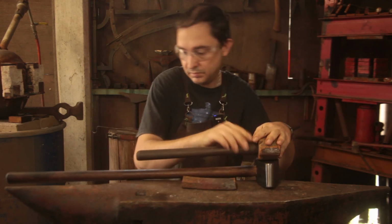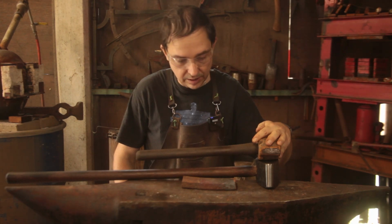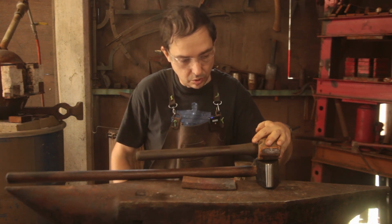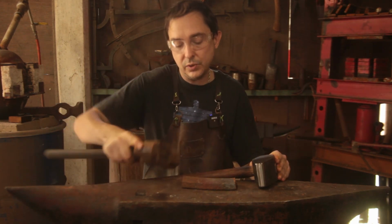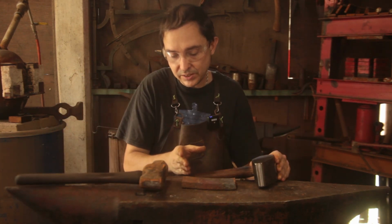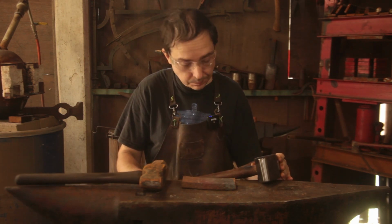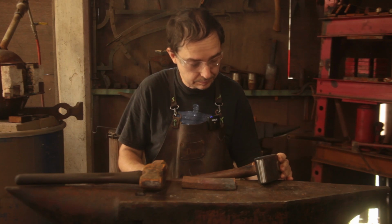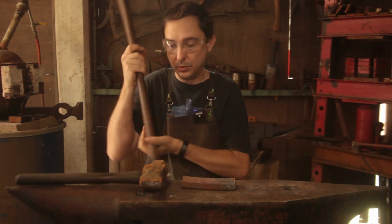line these up and yoink, and then I've got essentially two whopping great big drawing out hammers. This one is great for drawing out the body of axes, and the point of this one was to draw out beards and so on, and using it as a sledgehammer is going to be a bit difficult for that, so we'll trim it down, I think.